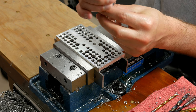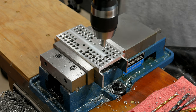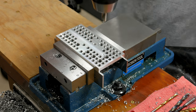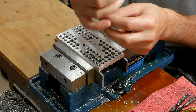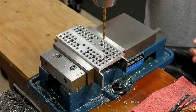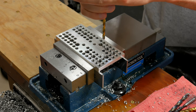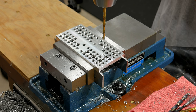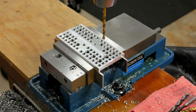I don't have any stub length drill bits, so I've been spotting all the holes. I've also been running the mill slower than I need to, mainly because I really don't want to have to change the speeds. This is a gear head, so changing speeds takes a little more time. With this many holes and multiple steps to make each hole, I don't want to spend the time changing speed, so I've just been doing everything in third speed, which is 345 RPMs.